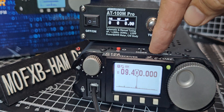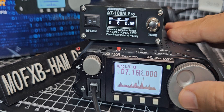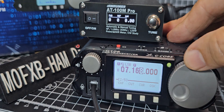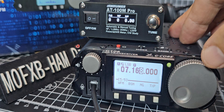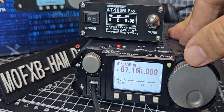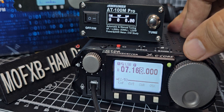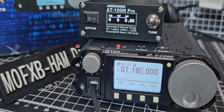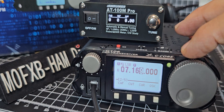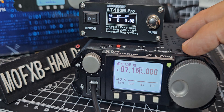You can change the bands up and down. On top you've got a function menu — press the large VFO and then you've got five menus. Basic settings starting with number one: VFO memory A and B, memory write, memory cancel. Number two is CW setting, and number three is mainly CW. You can change the frequency there.